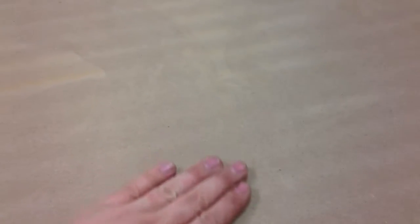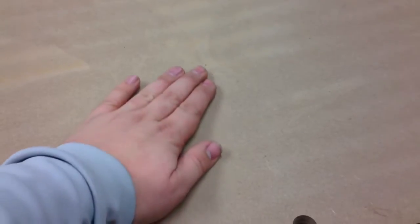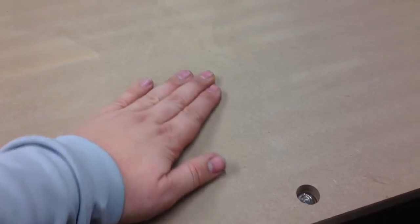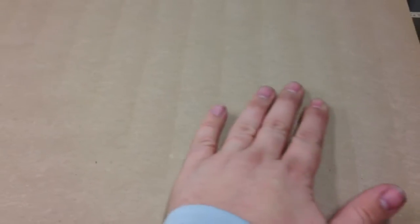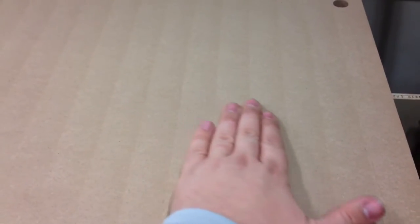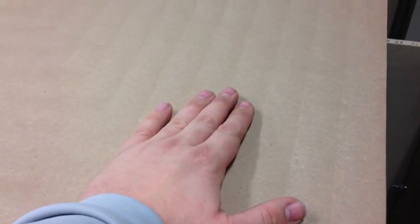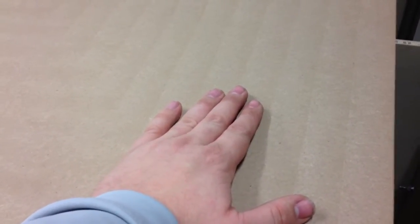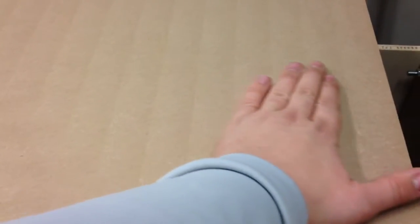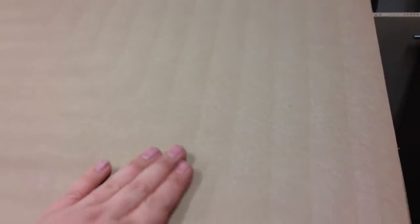I did get a surface pass done, and you can really feel that it is very smooth in this direction — there are almost no discernible tool path marks in the board this way. But in the other direction you can even see marks here. It's not bad; if I had to guess, it's maybe a couple thousandths of an inch. I think your tactile sense is right around a thousandth of an inch, around 10 microns or so, and I can barely feel anything. It's not quite perfect, but things are aligned pretty well.